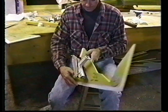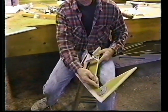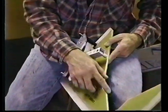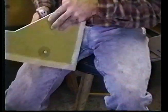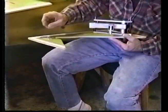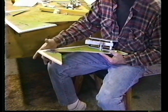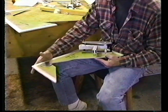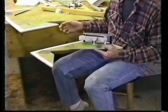That's what it looks like. This is the left side, corresponds with the NG8 position on the left. We are going to match drill these once we bolt it all together for this hole that's in place. Now there's wet resin in here, so we've really endeavored very carefully to remove all the resin from the inside of that hole so we don't goob up our bolt. Wouldn't hurt probably if you're installing this wet, and when you run that bolt through there, you put some mold release wax on the bolt so you don't lock it in place.